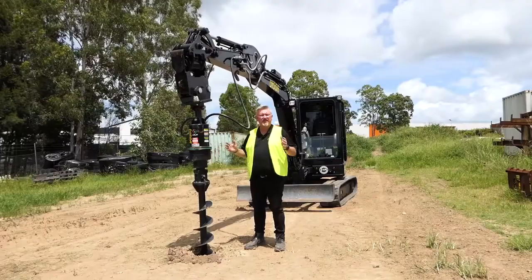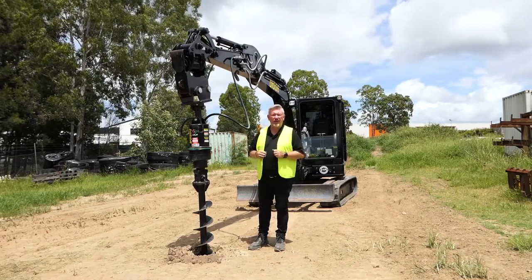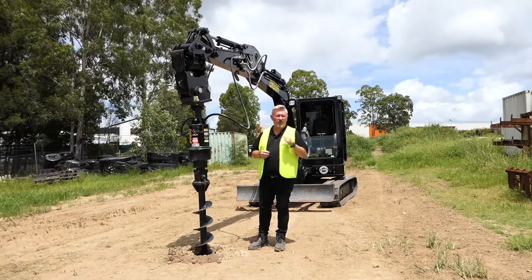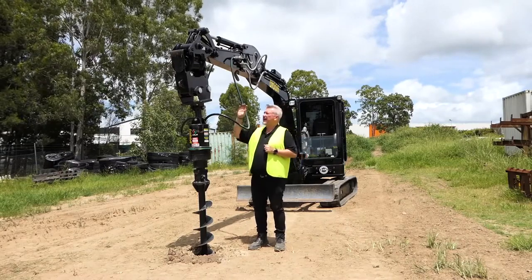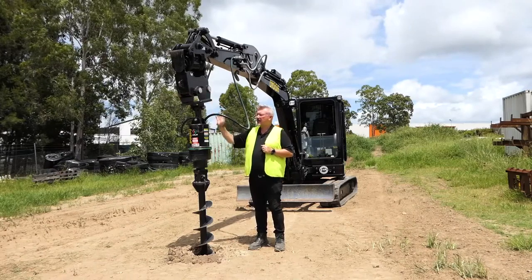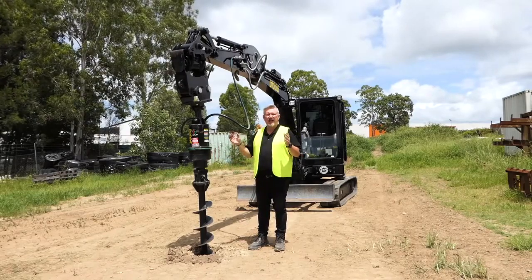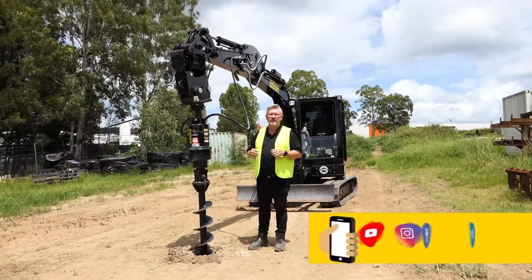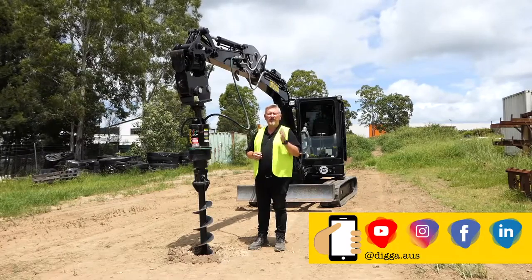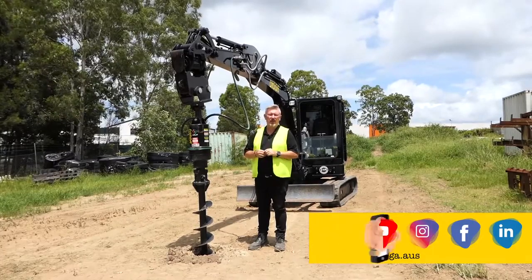So that's just the basic setup of how to hook up your auger drive onto your excavator. Plenty of you guys will have better ways, easier ways to set up your own ways in your truck or in your storage cradles to connect that. But it'll all still run through the basic connections of how you connect your hitch to your machine, your linkage to your drive, and your drive to your auger. If you need to check out any more drilling tips on different ground conditions or different attachments, check out the Digger YouTube channel, subscribe, give us a like. If you need more information, give us a call and talk to the sales staff — only too happy to help you out. See you guys.